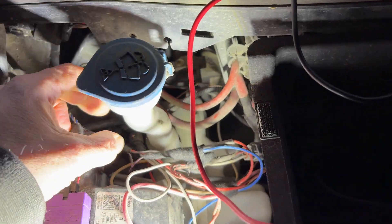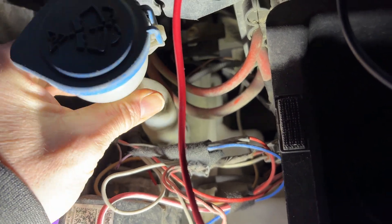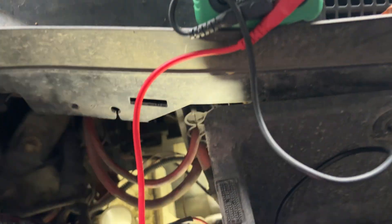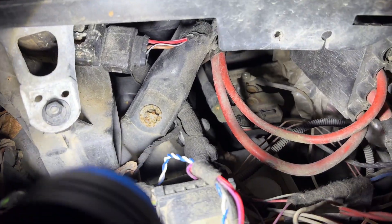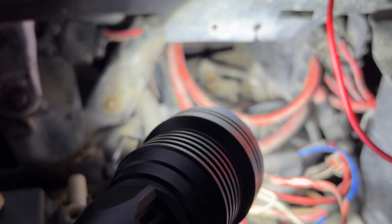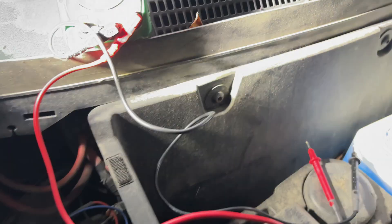This is a good check because when you see where the battery is on these cars, you'll realize the cigarette lighter is a very handy test point. I can turn and pull off this cap - watch you don't lose the O-ring, you always lose the O-ring. The battery location on this is in a very awkward place, with horrendous corrosion from the Finnish winters. That's the negative terminal, and I need to strip the front out just to get to the positive side.